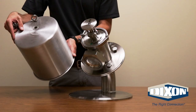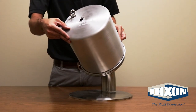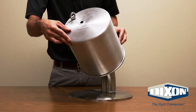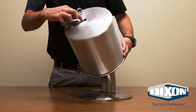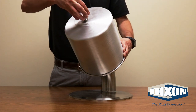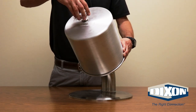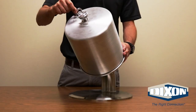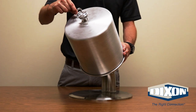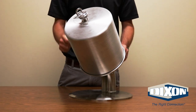After you have removed the hose and the end cap is connected, you can place the cover back onto the valve. When installing the cover, be sure to visually align the hole in the top of the cover with the tap hole on the handle. Rotate the cover as needed to align the two holes, then thread the cover nut back on and tighten. If you are using a safety seal, place the seal through one of the many holes on the nut and thread it through the eye bolt on the back of the cover.